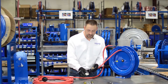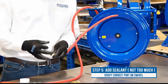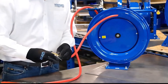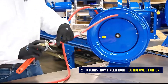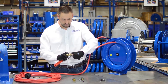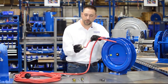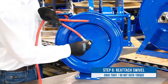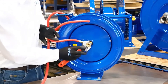We're going to assemble our hose to our swivel using standard NPT assembly procedures with a little bit of sealant — not too much. Be sure you use the right port and be sure not to over-tighten your swivel. NPT threads don't generally need as much torque as people think they do. Now we'll put our swivel back onto our reel the same way we took it off and snug it tight — there's no need to over-torque this.